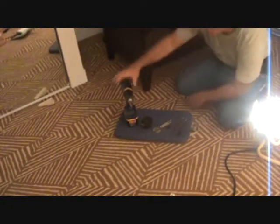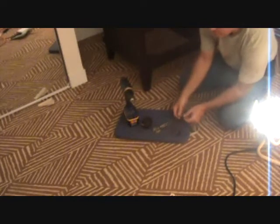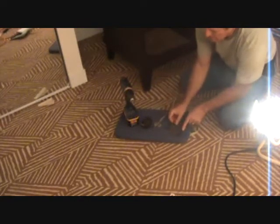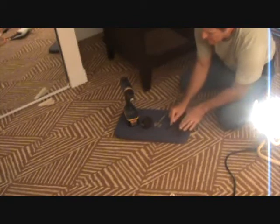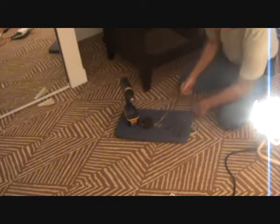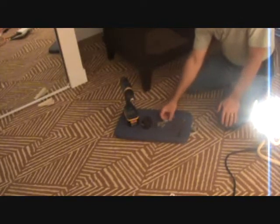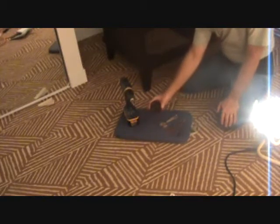I'm just going to use a cordless drill for this to drill the hole. Now, you could use like a paddle bit. These are little paddle bits, but obviously we're not going to use any of these for this project. 3/4, 7/8, 1 inch. If you have a small hole, you could get away with the paddle bit like that. Well, what I'm going to use is a hole saw.